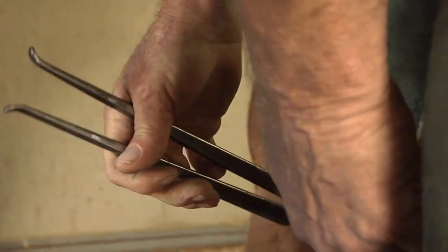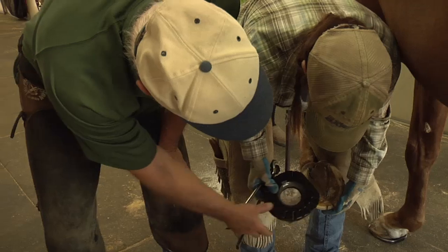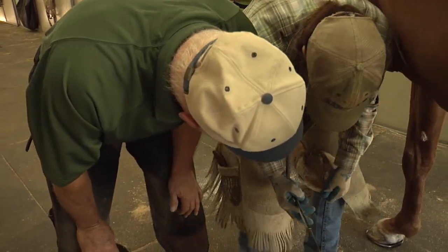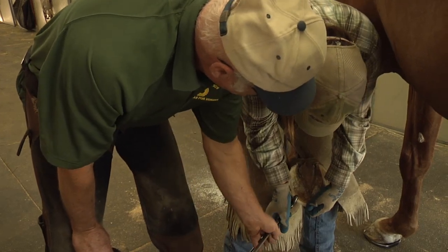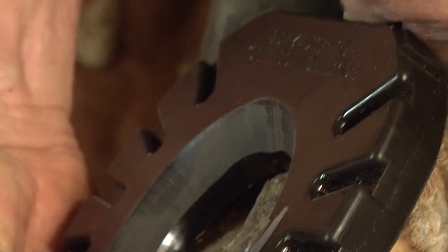I'll take a little notch of the hoof wall — it's just like fitting any other clip. The only problem is you can't burn these in; they do really poorly in the fire. Take about half of the hoof wall thickness — just that little half semi-circle. Make sure that instead of doing it this way, you do it this way. You want to go up the side of the wall a bit. See it comes to the very bulb of the heels here, so that's good support. We can take a little off or more if we want.